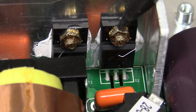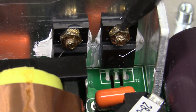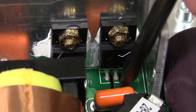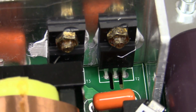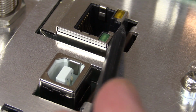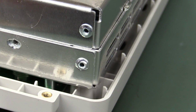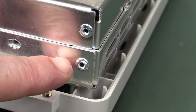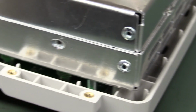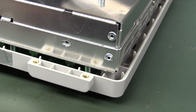These nuts and bolts look a bit how you doing. It's like, have they been super glued on or something? Anyway, I do like the isolation slots between the pins there. Nice touch. Got the RFI shield tabs nicely on the Ethernet and the USB connector there. Yeah, someone knows what they're doing. You gotta love the pop rivets. Look at this. You can just picture the production workers there with their pop rivet gun, go in, ka-clunk, ka-clunk.